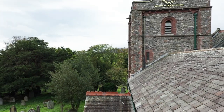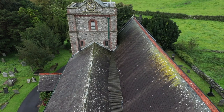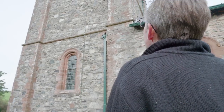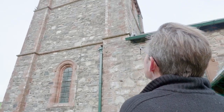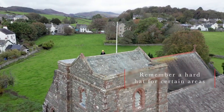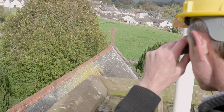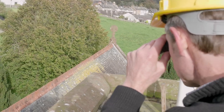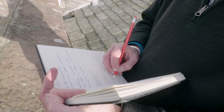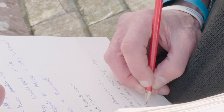To get a clear picture, it's always useful to try and view the roof coverings from as many different angles as possible. As well as examining the roof from the ground, the church tower is a good vantage point if you have one and it's safe to access. To get a closer look you can also use a ladder, but again only if it's safe to do so. Binoculars and high resolution photographs can also be useful, and creating and marking up a roof plan can also be a helpful tool for noting down any problems.